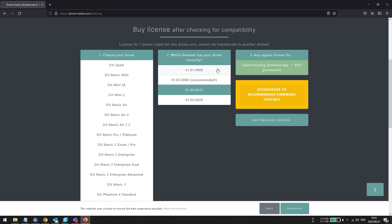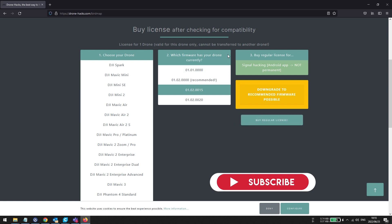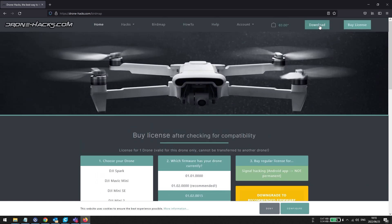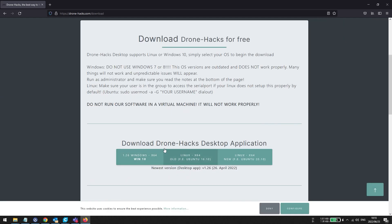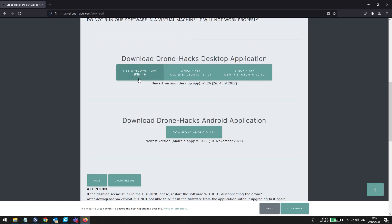With the way I'm going to show you now, you don't need an internet connection — you can actually download the files offline and whenever you need to, you can flash the firmware offline or online, whatever you want. So click on Downloads, click on DJI — it doesn't make much difference since we're using DJI goggles. Note that it does not support Mac; you will need Windows 10, and in some cases Windows 11 is starting to work but it's not fully supported yet. Click Download Now.